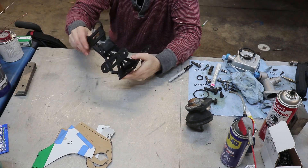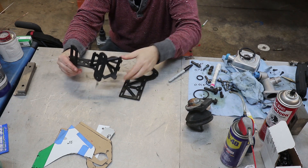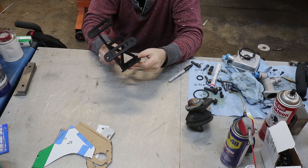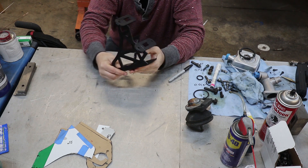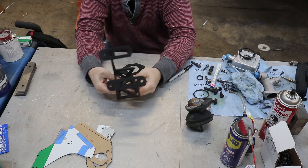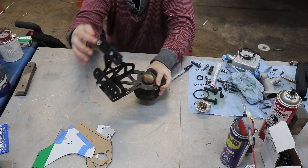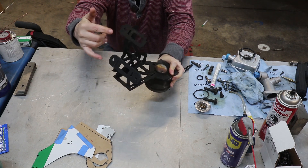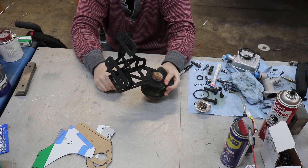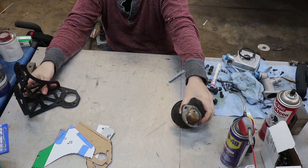I utilized that design to plan out some parts that I sent to my 3D printer. I was able to print these parts in plastic and see how they fit together, using tab and slot construction to get it all built, so that it would go onto the engine mount and bolt onto the engine block. Then I tweaked the design some more and uploaded the files to an online laser cutting facility.